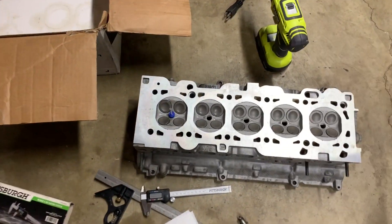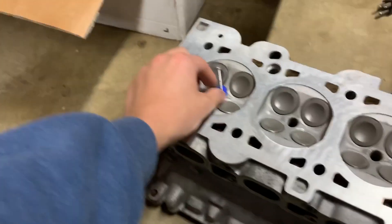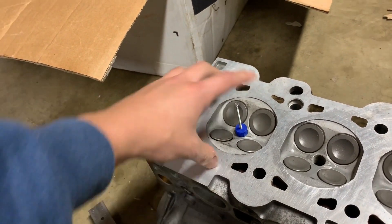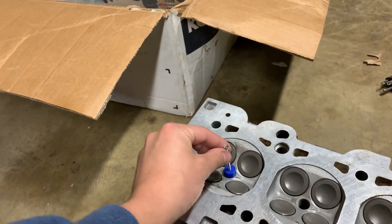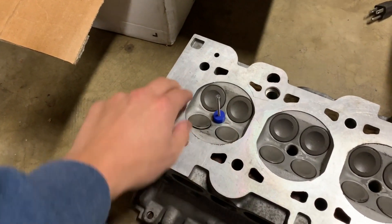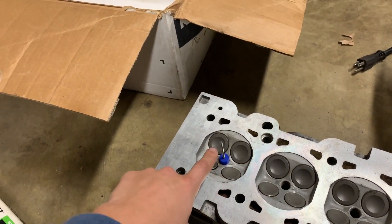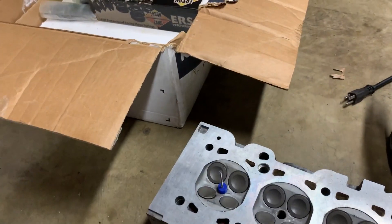Here's what I'm working on now: I have to create a cylinder head mold for the piston. I 3D printed an M14 by 1.5 plug and screwed it into the spark plug hole. I'm printing another piece that goes around it and uses a bolt to center it in the cylinder. Once centered, I can hot glue around it to seal it, and I'm going to fill the cylinder head with Bondo up to a certain level so it doesn't leak out.